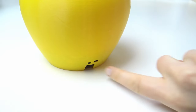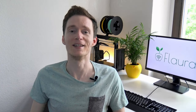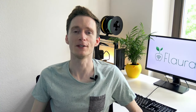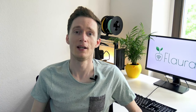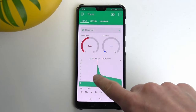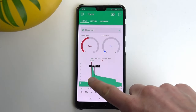Alternatively, the microcontroller can also be woken up manually by a simple button press. Since almost the whole day is spent in power saving mode, the LiPo battery will last for many months depending on your plant and its water needs. It can be recharged with your regular USB phone charger. I am toying with the idea of also integrating solar panels into the housing in the future, so you won't have to recharge the battery at all. The WiFi connection of the ESP32 can be used to remotely control the plant pot, change its settings or send the sensor data to your phone, your home server or websites like ThingSpeak. Personally, I use an app to keep track of the water level, battery level, soil moisture and the pump activity. The data is timestamped, which allows for easy backtracking.